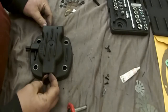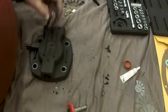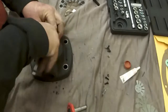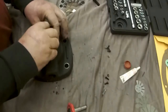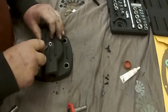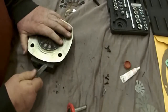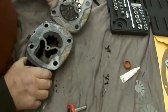We're now going to rebuild the high-pressure side of the 2545. The customer put a plug in to keep any debris out of the discharge side of the high-pressure. I'm going to take this center bolt out — it holds the plate on. We loosened this already when we took the head off the compressor. If you don't loosen it on the compressor when the four other bolts are holding the head in place, sometimes you'll throw it on the bench and that bolt's a little tighter than it is easy to get out. Don't forget to hang on to your washers, especially the copper ones. Some kits come with copper washers, some don't. You can always reuse these copper washers unless they're ragged or really bent.